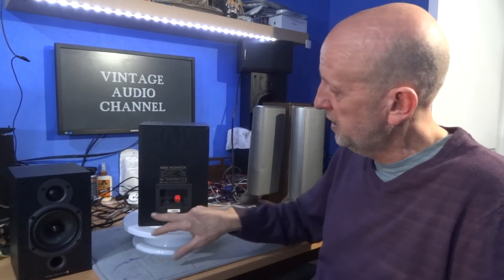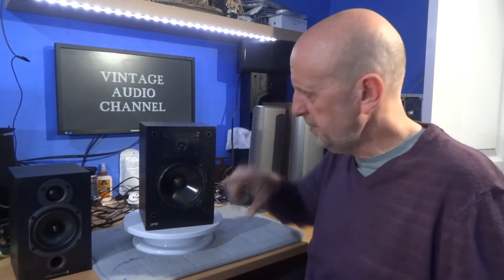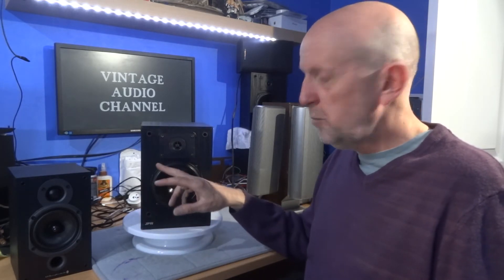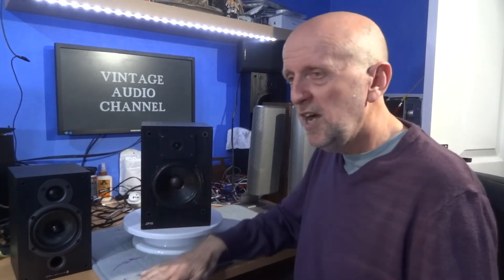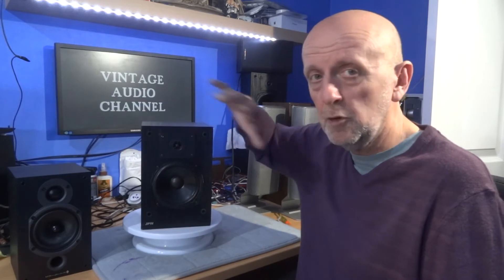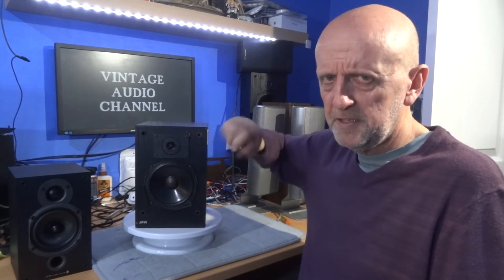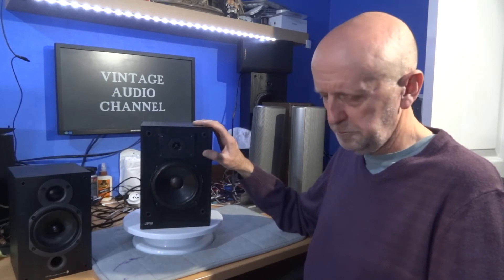That's the back with normal screw terminals, and the screws poke through the enclosure to the other side. I'll mention again — I haven't come across a speaker yet that I've bought where I didn't have to tighten at least one of these screws. One of them was surprisingly loose. Check all these screws and do them up as tight as you possibly can, but don't go too mad because you're screwing into chipboard — if you go too far it loses grip and you'll need a bigger thread screw to get it back.